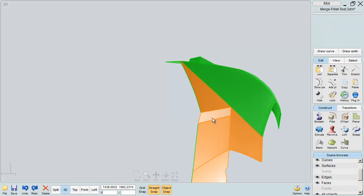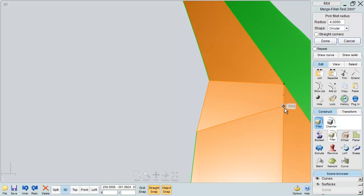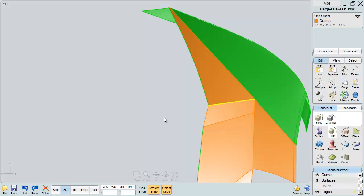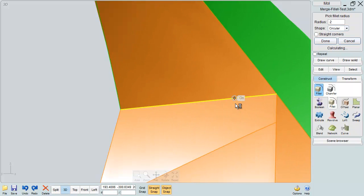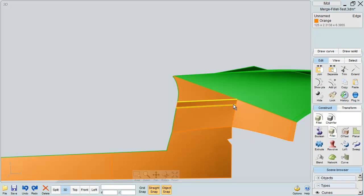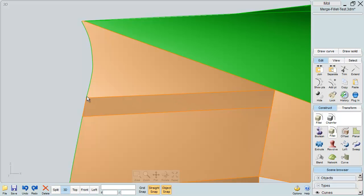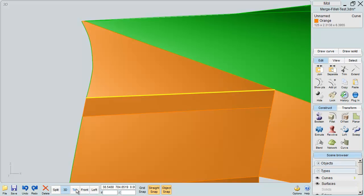Fixing that would be creating a new surface there that actually touches the two surfaces and then having those joined together. Then look and see if filleting that is going to be better. This one goes from infinity down to something so it's probably not going to fillet well. So what I wanted to look at — in all these areas — say you don't want to run that blend the whole way; all you want is a tiny little blend on these hard edges.